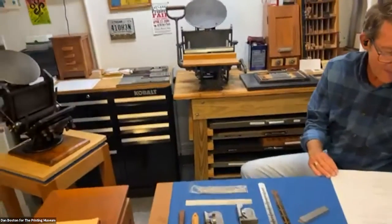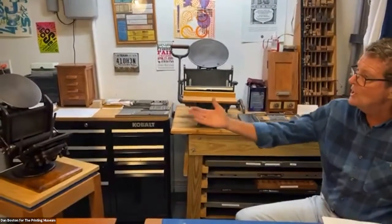Let's see. We talked about smaller in size, weight means that all the pieces are smaller. And you are compressing two pieces of metal when you, that's the main action, when you actually bring the paper up and press it to the form. That puts many pieces in tension in the mechanism of the press. And this cast iron is a brittle material. It does better in compression, pushing together, than it does in shear or tension. And they will snap, and you can easily do that.